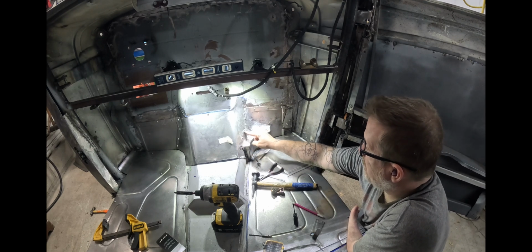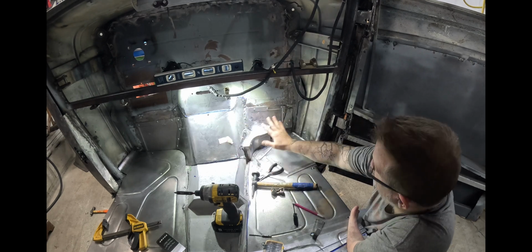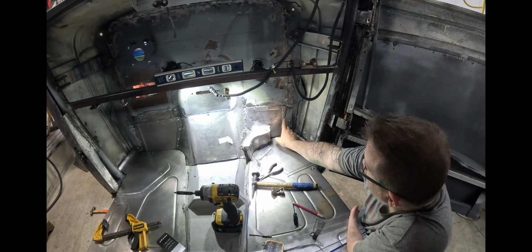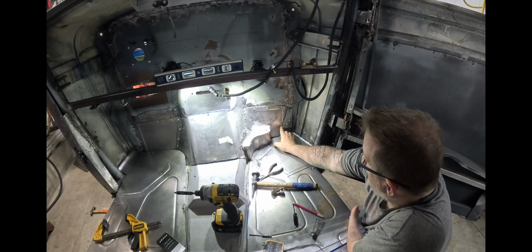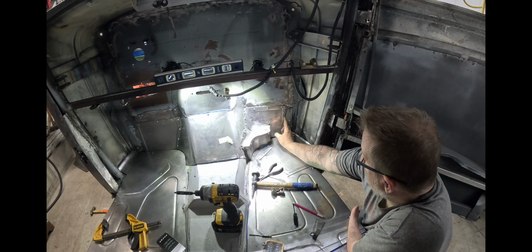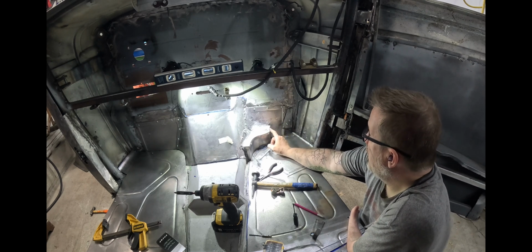So, like, spot weld, and then I'll seam seal everything. Probably even these that I put together, definitely along there. I'm going to make that push up tight and weld that solid. From here to here will be welded solid, both this side and that side.